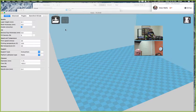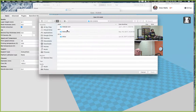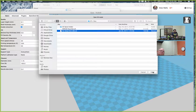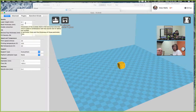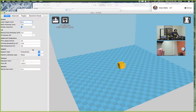It's as easy as clicking Load, and then you'll navigate to your SD card. On your SD card you'll find all of the models that we're going to use today inside the STL files folder. Here's the six-sided die that we printed. So we'll click Open once we find it - it's the .STL six-sided dice - and then it's just going to stick it right in the middle. And this over here is the slice time, so that's how long it's going to take to print. If I change the layer height to 0.3, you'll see it's only going to take 10 minutes because those layers are thicker, but it won't look as good. You can also change the speed - if I change this up to 52 millimeters per second, now it's only 8 minutes.